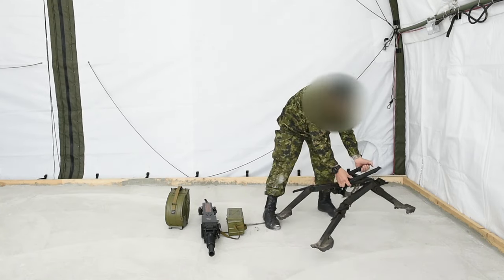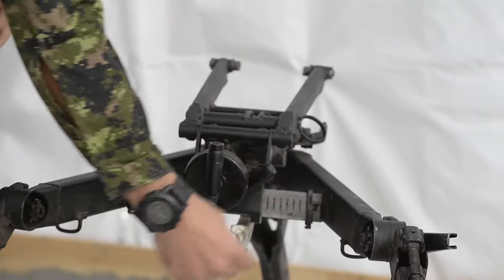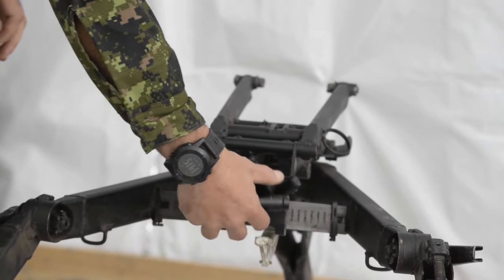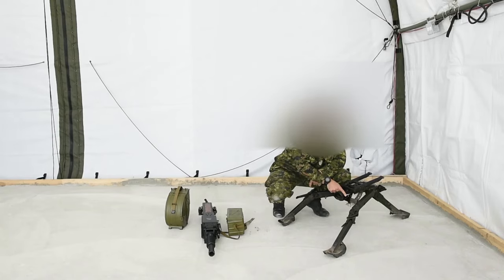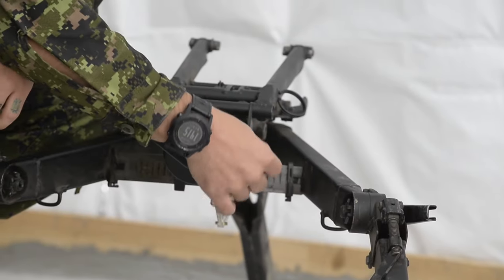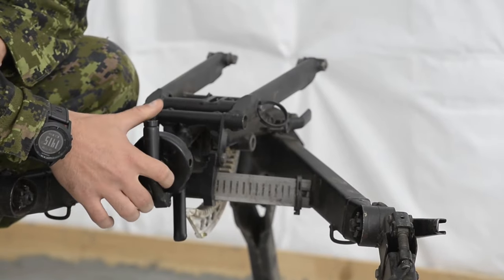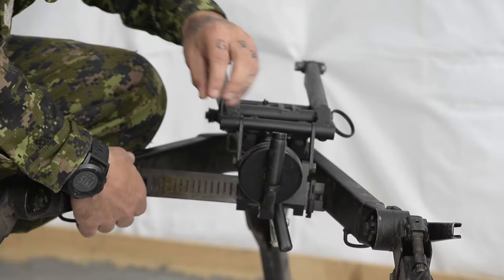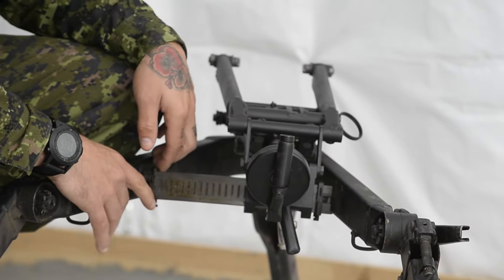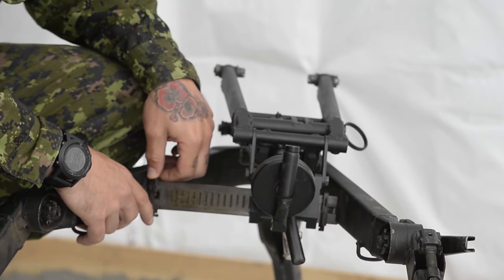In the back right here you have elevation and depression — close it and move it for fine tuning. And right here, this little lever: unlock, lock. Once it's unlocked, it rotates left and right. You also have these black markers on either side, which can be adjusted for either arcs of fire or if you have final protective fires.